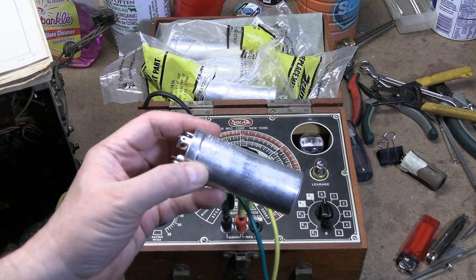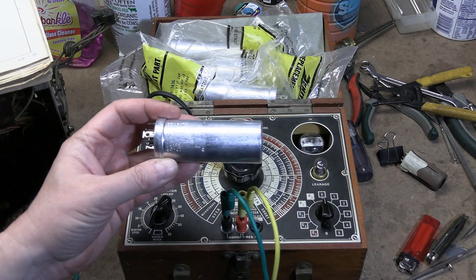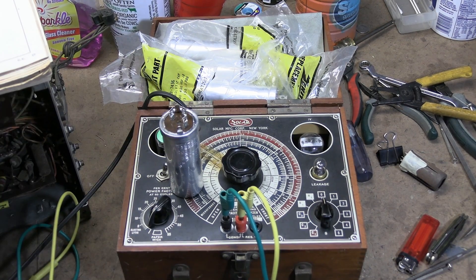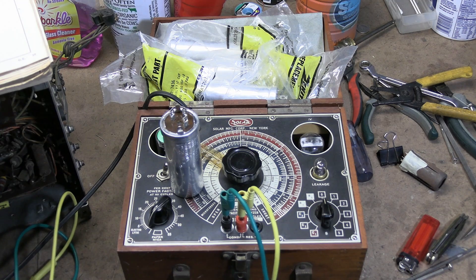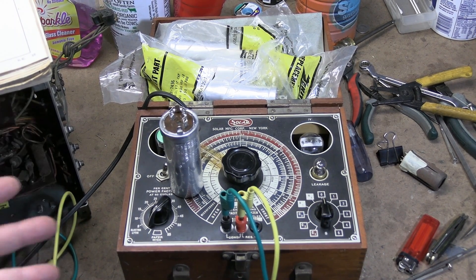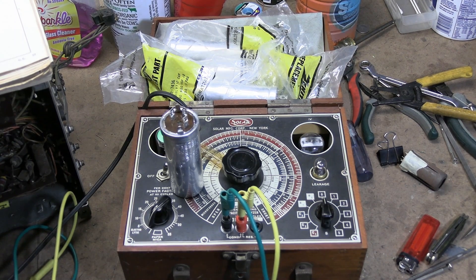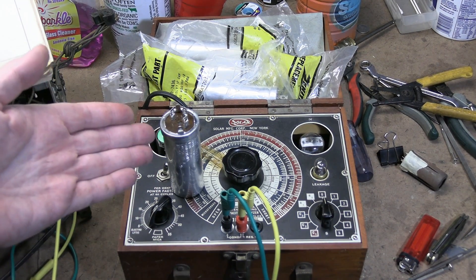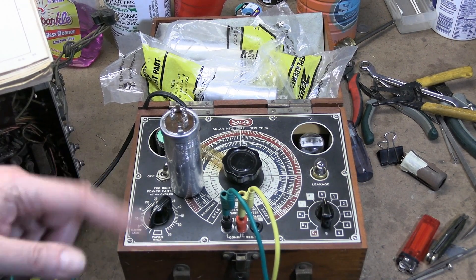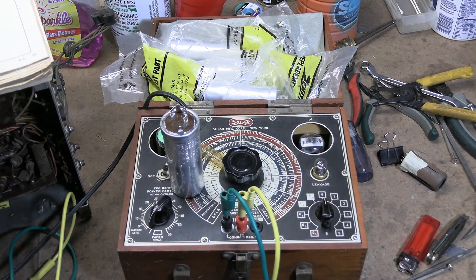The thought being that these have a limited life even if you don't use them. If you look at a modern electrolytic manufacturer's data sheet they even mention shelf life. What they talk about is if it sits for a while — whether it's a cap from 50 years ago or five years ago — they need to be formed up, kind of like a car battery. The chemicals, the oxide layers and whatnot need to get built back up under a controlled, slow process. Ideally if it's been sealed, the electrolyte chemicals inside didn't dry out and didn't degrade, and the paper insulating material didn't disintegrate. It could be possible to form these up and use them.